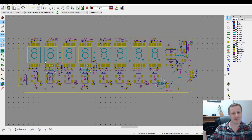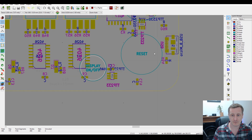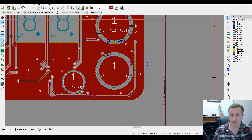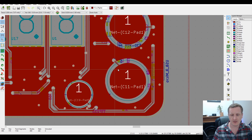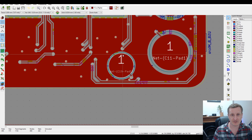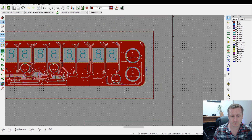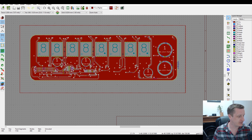When the hours hit 24, everything resets back to zero — essentially restarting from midnight. TTP233 touch ICs are used as single touch sensors, with touch pads created on the front of the board. Two pad spacings are being tested: two millimeters separation from the ground copper layer on some, and one millimeter on others, to see what difference it makes.